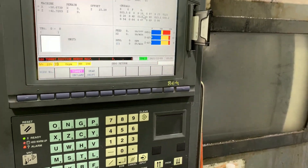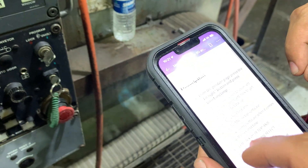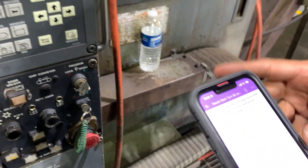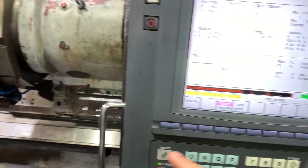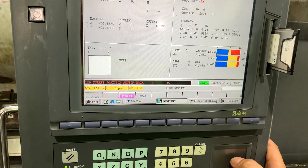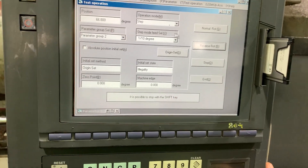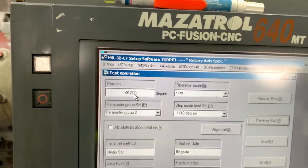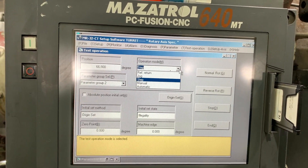Let's review the procedure and do the home position by following this procedure that is in Teams - the MRJ2 drive home position set. We need first to unclamp the turret and be on the mechanical position number one. Then we go to the MRJ2 and select this as our home position. It should be zero at the end of the procedure, so we need to select reference return.